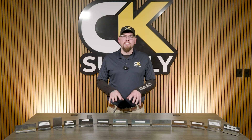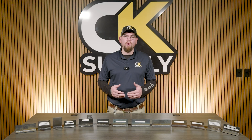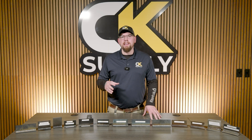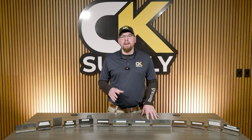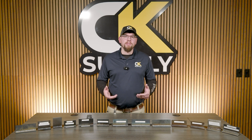So we go to the next transfer mode: spray transfer. With spray transfer, you can get the most amount of fusion because of the high energy current being achieved. You can see the depth into the legs and root of the joint. But the downside is spray transfer can only be done in the flat and horizontal position. It is a high heat, high deposition weld and is too fluid to be done out of position or overhead. It also needs a specific gas blend — 80% argon, 20% CO2 minimum is required, while the best blends are 90-10 or even 95-5. Arc stability increases as argon increases. If you have the option for pulse spray, which is machine specific, you can get the benefits of spray transfer while gaining puddle control and dialing down the massive amount of heat input you also get from spray.